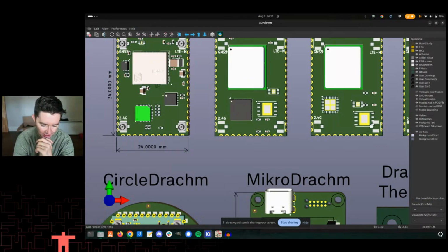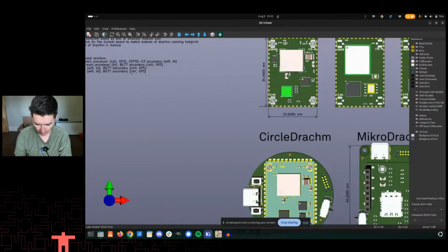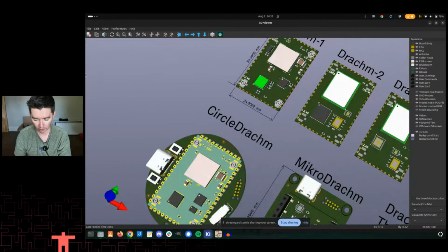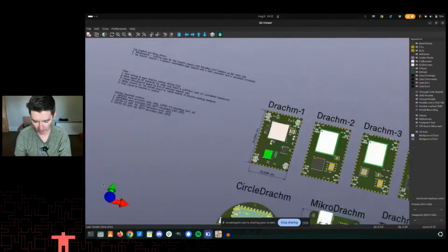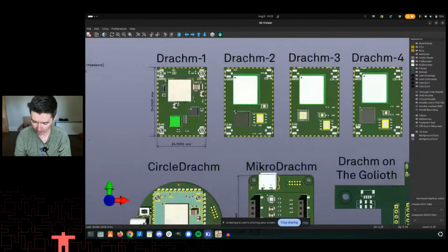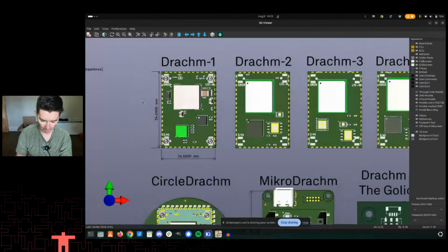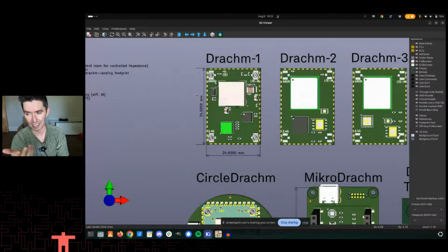And let's actually talk a little bit of layout now. Okay, so we talked a little bit about RF. These are all going to be 50 ohm traces for RF. That's just kind of the standard that I work to. I think some people do 75, but it's way fancier than I ever would do. USB is 90 ohms differential. Ethernet, I believe, is 100 ohm differential. But we're just going to do the RF stuff right now.